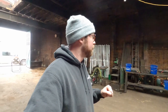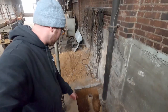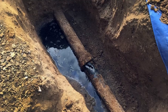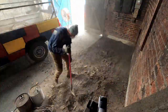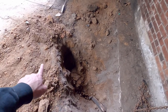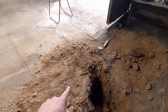Thanks to Lynn Horn, a local plumber - she is a badass - what she did was put her fancy camera down in the sewer where the toilet was and ran it. I dug this hole out here to see where it goes, and I knew it went that way because you can see down there, but she ran it that way to see where the sewer went. Lucky for me it went straight, just like a lot of these old buildings tend to do - it's all sectioned cast iron pipe. I dug a hole here a few weeks ago with Wyatt, hoping if I dug the same distance off the wall as it is back there I would find it. I didn't find anything, so I got a little discouraged - that's why I called Lynn. She put her camera in and in fact the sewer pipe was just a little to the left of where I was digging. So we found it, it is right there.